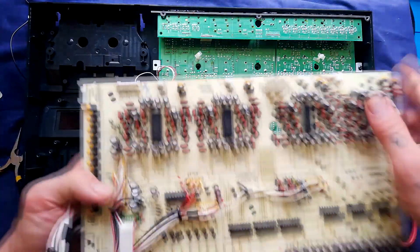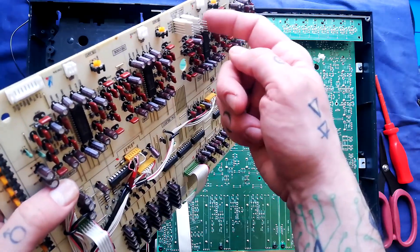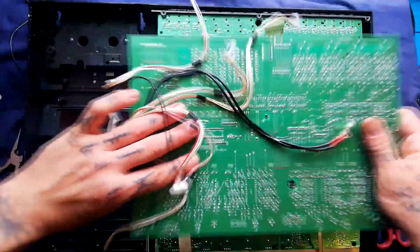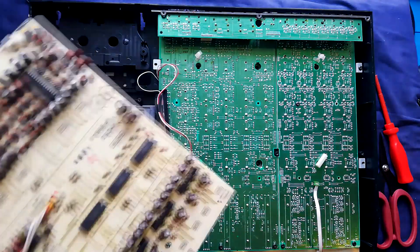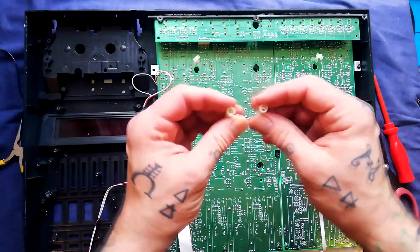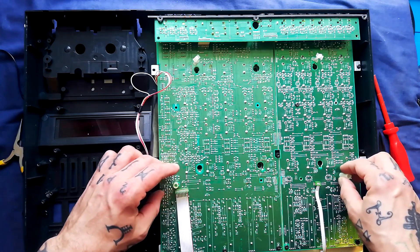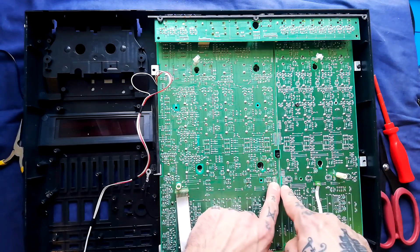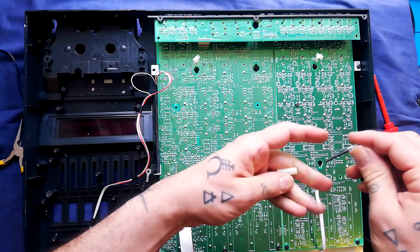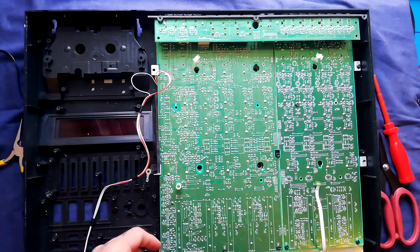One pin is slightly bent — these connectors have four pins each passing through two holes. I kind of tipped it sideways which isn't good for the pins; you obviously need to put it straight down so those pins go straight into those holes. Looks like there was a spacer there for that screw, and actually there were two of them — I heard something rattling around and didn't notice the second spacer as I was taking it out. This is going to be fiddly to put back because we've got to have those pins lined up perfectly and find a way to reattach all those cables.